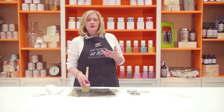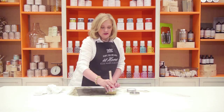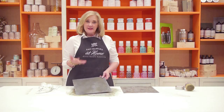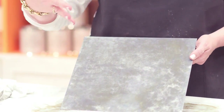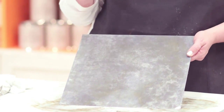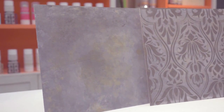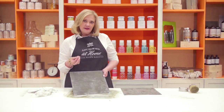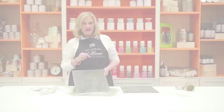A lot of people ask: can I put food directly on top of it? You want to use a cutting board — some type of protection. Zinc will scratch, but to me that just adds to the patina, because they're so utilitarian — they just look better and better with age. After I've allowed my wax to dry for about an hour and buffed it with my lint rag, I can see the beautiful patina. I love the depth of that beautiful chalky dead finish with just a little bit of greening. Remember, no two of these will be alike — this is a process taking place as you do it, so enjoy the fact that it's a one-of-a-kind.